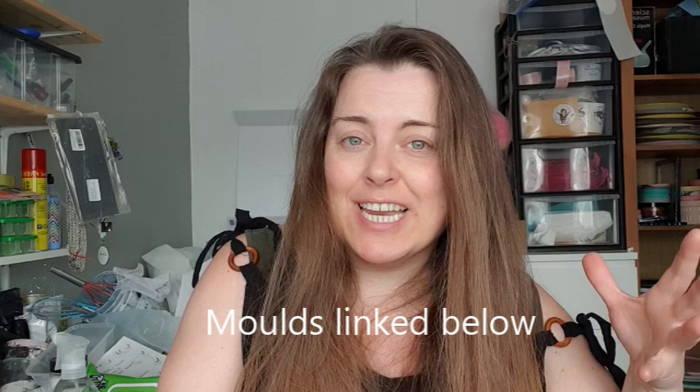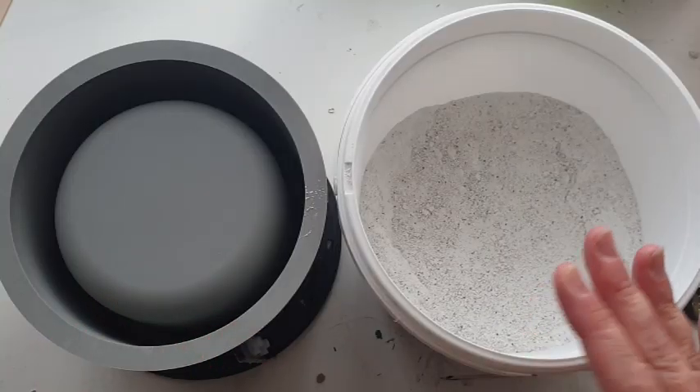We're also going to make a Jesmonite tray with handles, and that was purely because one of my amazing subscriber friends, Linda, asked if we could put those handles in Jesmonite — would it stay? My gut feeling is yes, like the resin-handled trays I've made. My biggest worry is that the bubbles in Jesmonite rise to the surface, which would then be the surface of your tray, so it's not like epoxy resin where you can torch them out.